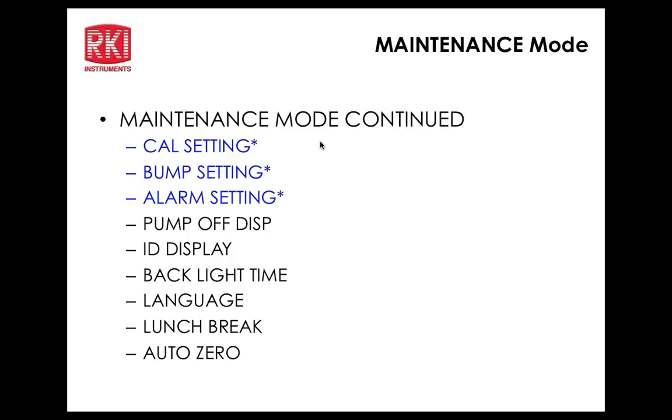Bruce, if we set that CO to zero suppressed, will there still be the deadband on the sensor? No, that's what that means. Zero suppression is basically the same as a deadband. So if you turn that to 0, then there's no deadband for that particular sensor. So there's not a capability of that on the 2009, and we've not been able to get it on the 2012, right? Right. On those it's hard coded at, I forget what the level is, but it's not changeable. The Eagle 2 and this instrument are the only ones where you can actually change those values.